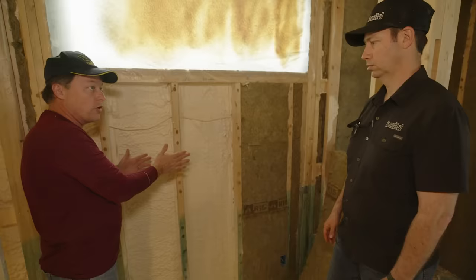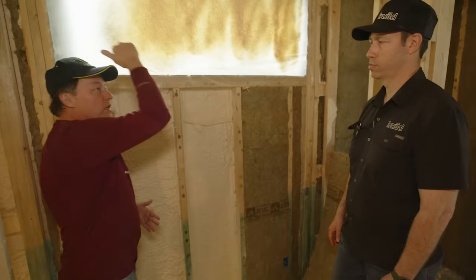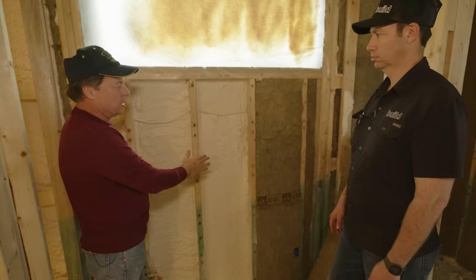Plus, the other thing on any fibrous insulation, you're not going to get your R value out of it unless it touches all 6 sides. That's right. So we have to meet up to the drywall. Mm-hmm. Now, if I'm doing sound in a ceiling, that's not the case. I don't need to fill that cavity. Yep. But in this case, we really are going for sound. Mineral wool is a phenomenal product for sound. So now all we're trying to do is just make sure we come right up to the studs.